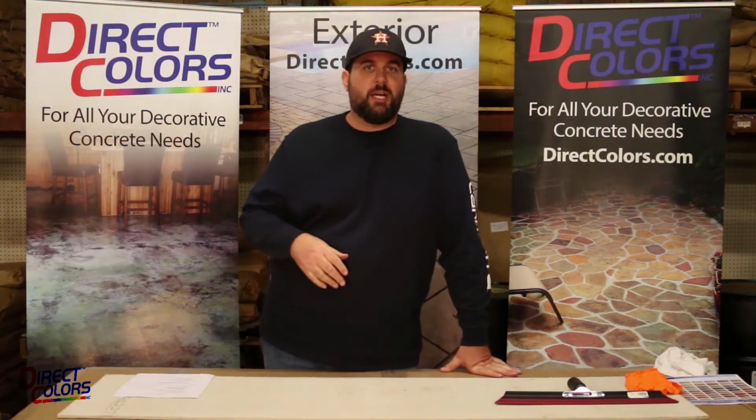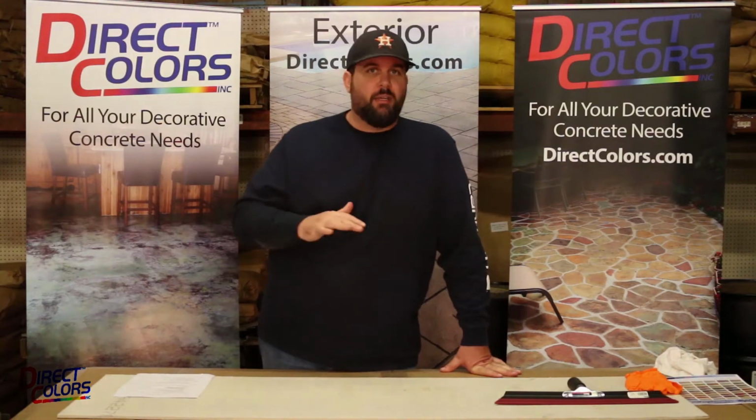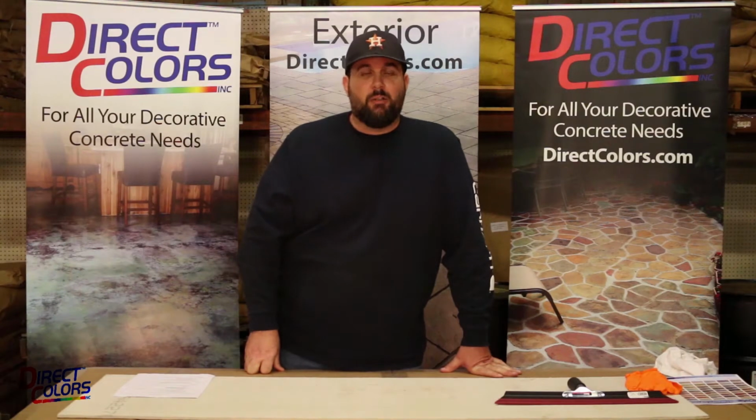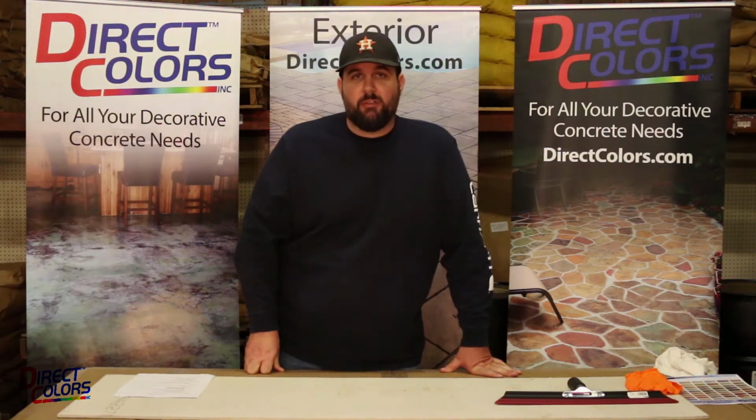So knock out the low spots first, let it dry, give it a really light sanding, probably no more than a 150, 200 grit level, and then come back and apply your overlay accordingly. We'll move on and show you how to get this stuff put down. I think you'll find the video interesting and helpful, and you'll see just how easy it is.